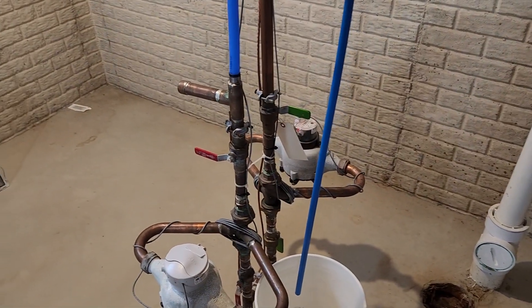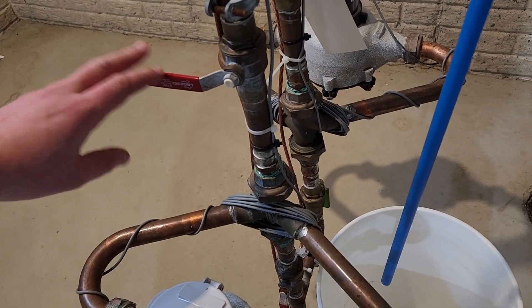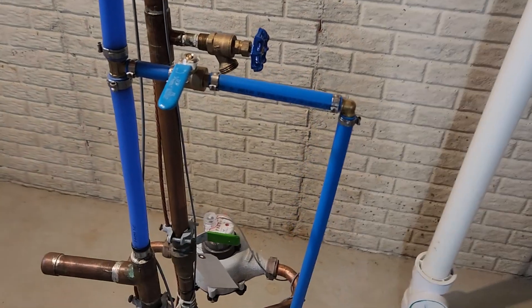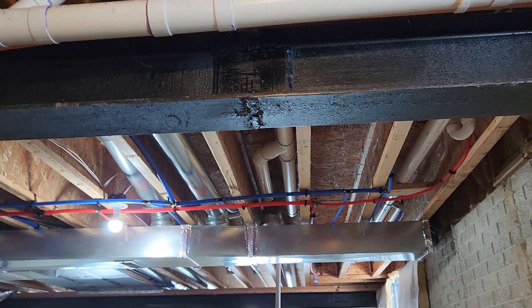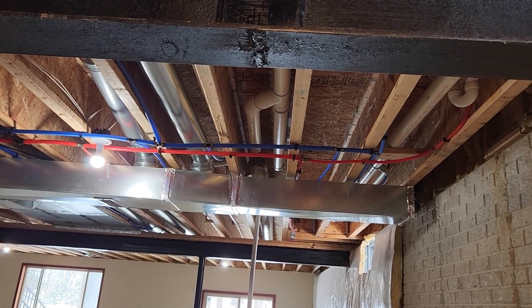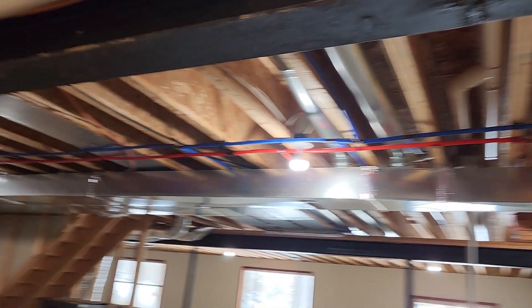We are down at the water main. I went ahead and shut off our city water to the house. Then we will go ahead and use this drain valve here to drain out the rest of the water that was up in the system. That way when we disconnect everything up at the toilet and where that isolation valve is, we don't have too much excess water coming out all over the tile.